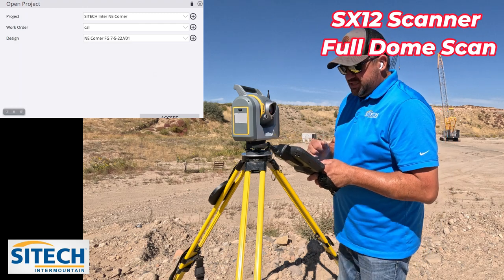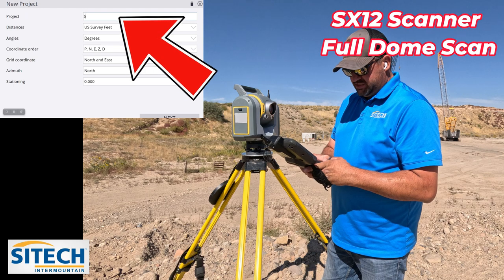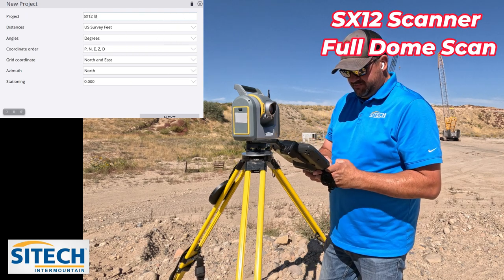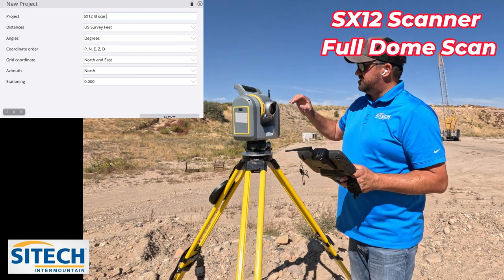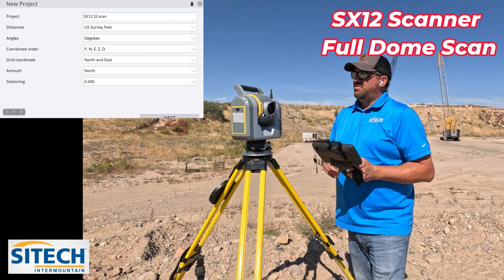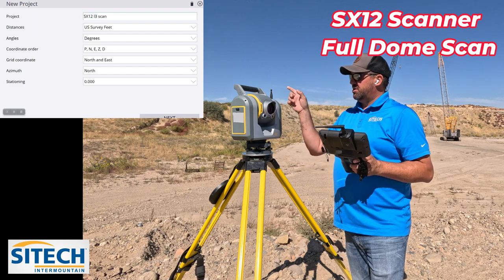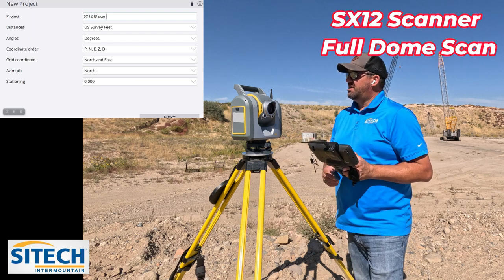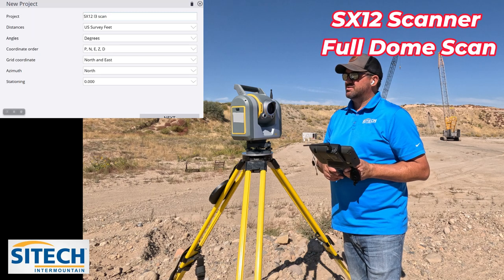So with any Siteworks settings, go ahead and just create a new job site. We'll just call this the SX12 L3 scan. We'll create a job site. This is just like any other total station where you can backsight it into control points. In this video, I'm not going to actually backsight it in, but it would be like any other one where I would either shoot targets that I have, shoot backsights, or walk it and do that. I'm going to just do a job site that's just a default, northing and easting, and we're going to go ahead and scan this hillside.